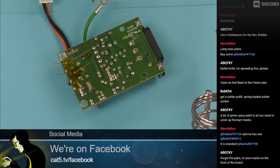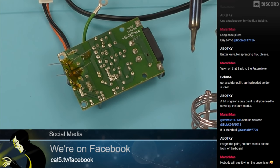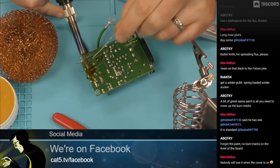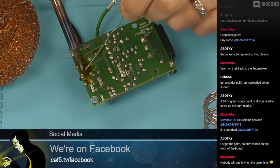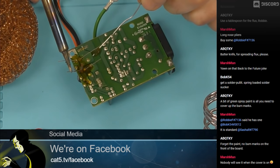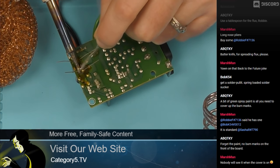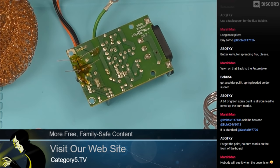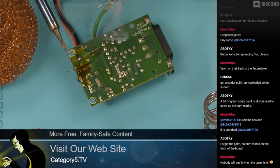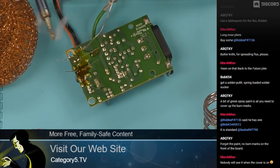Here I'm not having quite as much success. Looking at the tip of my soldering iron, it's kind of welled up on the end of the tip, which I want to avoid. So I'll just grab a dollar store wire cleaner and clean off the tip — you don't have to buy the $30 soldering component to do that. So I'm heating it up and then applying the solder and pulling up — and now we've got a good joint there.